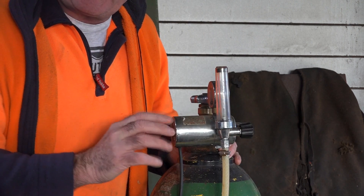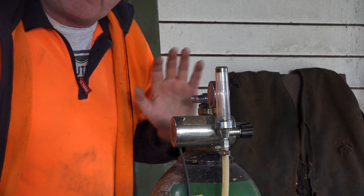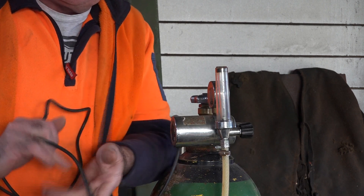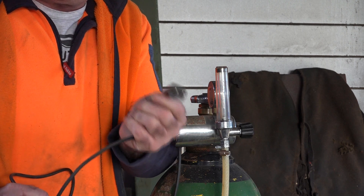I've got this big thing here — and you know what that is guys? That's the heater. What that does is it heats the CO2 as it comes out into the regulator before it goes into my torch. It's got a cord here and the other end plugs into the back of my welder — it's a 24-volt heater.